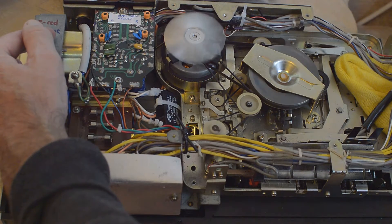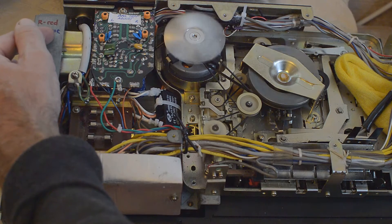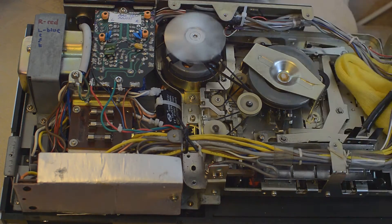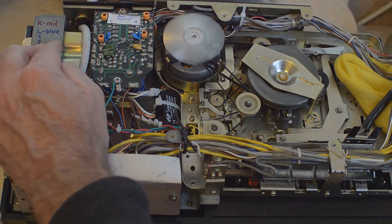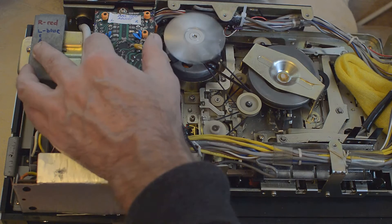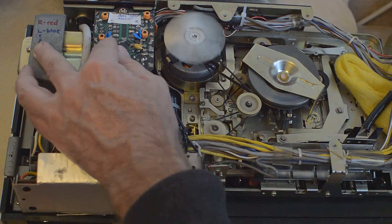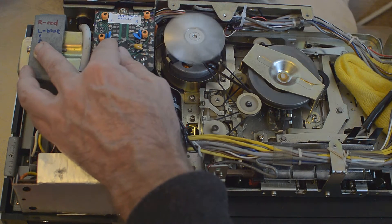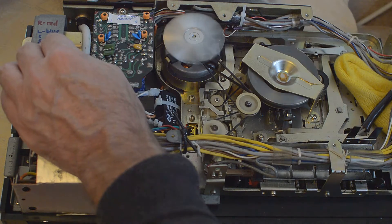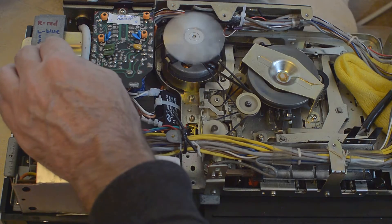The original capacitor bank design used bridges of solder to make up the required capacitance for the bias circuit. What I've done is taken the old capacitor bank out and replaced it with my own 100-volt rated trim capacitors for left and right channels, in series with something like a kilovolt-rated ceramic capacitor for both channels. I can now alter the bias carrier voltage from about 15 to 25 volts, and possibly even higher.